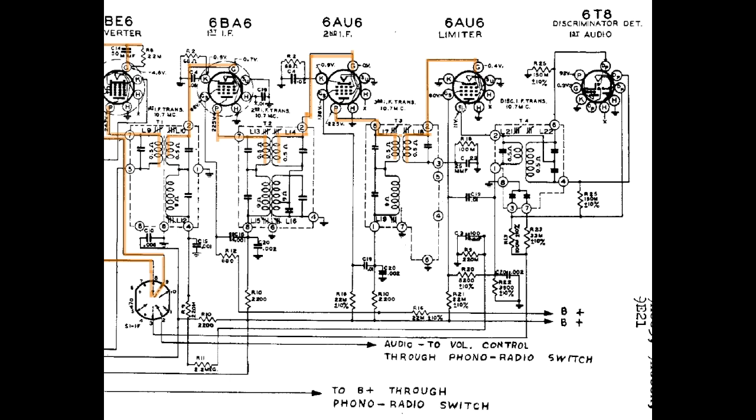Positive and negative excursions. Remember, this is an AC signal, so the positive peaks and the negative peaks don't have any AM content at all. Otherwise, it's going to go to this next stage and be converted back into an amplitude modulated signal, which is what the discriminator does. So we've got this thing that clips it, cleans the tops and bottoms off, and only allows the frequency modulated carrier with information on it to go through, no AM at all.